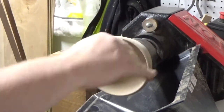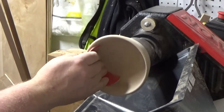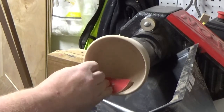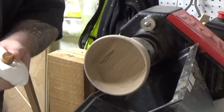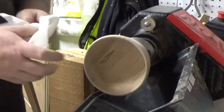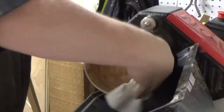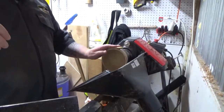I think my favorite part of woodworking — there's just something so nice about sanding. The finish for the most part is usually really nice. I've been really practicing on taking that last cut to get it as perfect as I can. I'm just wiping on water so that it raises the grain up and I can de-nib it with some sandpaper.